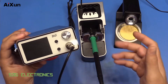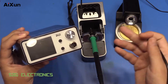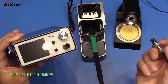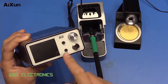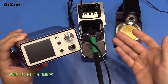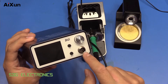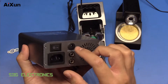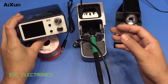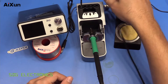On the T3A, you can actually use the T12 and the 936 handpieces without any kind of modification. You just plug in the connector and it will detect that it's a different handpiece and drive it accordingly. However, a word of warning — there are various different types of T12 handpiece; some of them have sense resistors in different places, so you might need to pick the right one. Unfortunately, they haven't made the T210 and the T115 handpieces compatible with this original base station. So now if you want to use the smaller handpieces, you need to buy that different station that has a power button and the multi-pin connector at the back. That's probably a slightly better layout because it means you can have this slightly out of the way, and your handpiece connector just goes into the back — a much less messy wiring configuration.